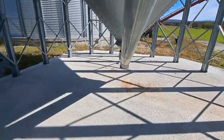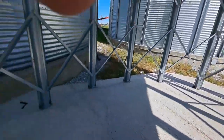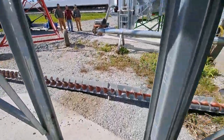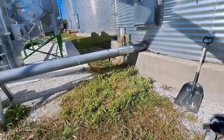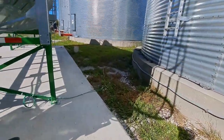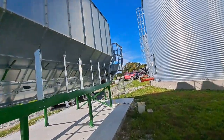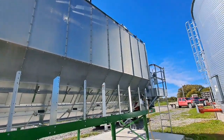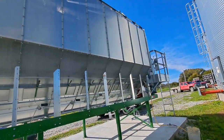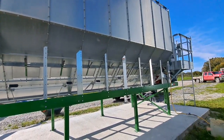So we're starting to fill the corn. We got 28% corn. Dryer's gonna fill from the back because we're filling in the back, and work its way front through. Once the dryer's full, then we're going to fire the fan and heat up and start warming it up.